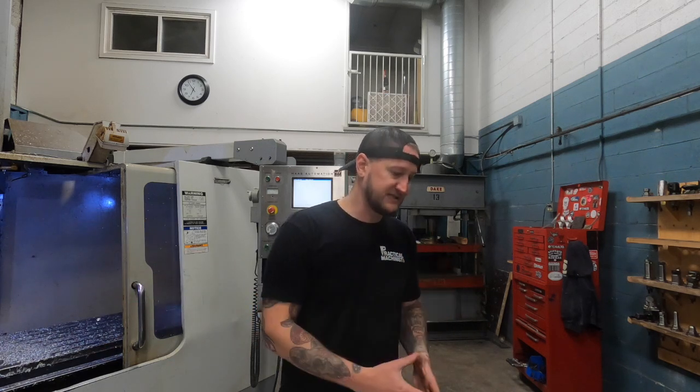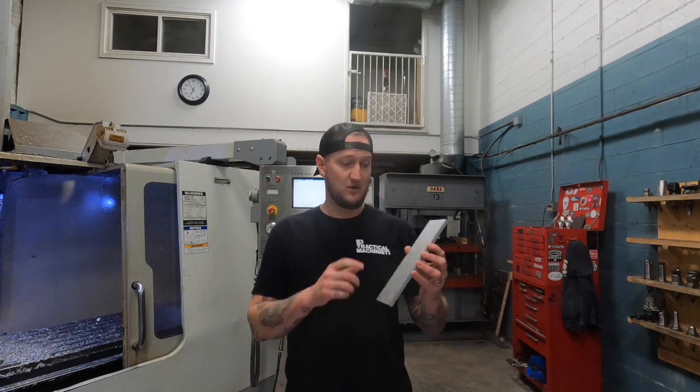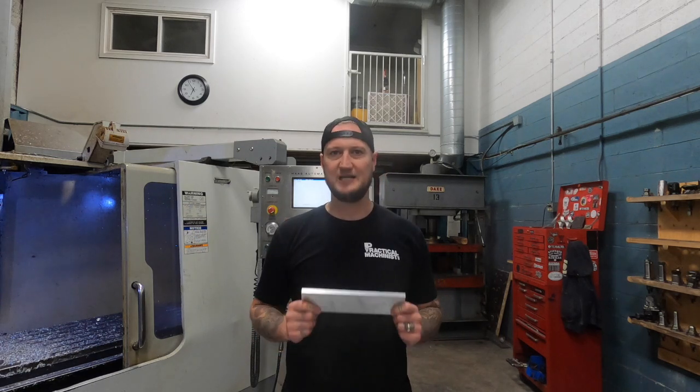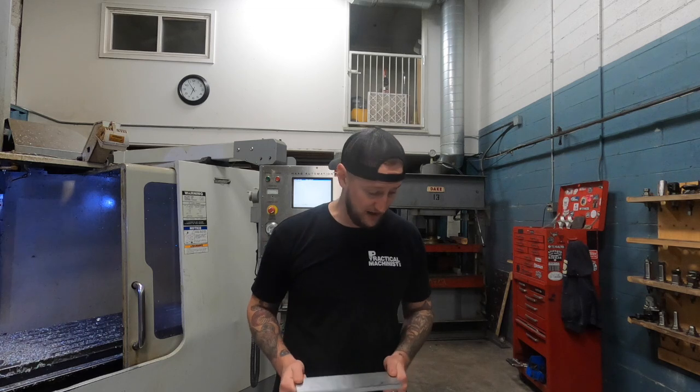I always like to think simple, and then build up. Does this part need to be strong? Does this part need to have corrosion resistance? Does this part need to have wear resistance? Basically, I'll start from somewhere like aluminum and just say, is aluminum gonna do the job? No — what about mild steel? No — what about stainless steel? And build up from there. Basically, I start with the most readily available and easy to machine things that I can, and work up from there.